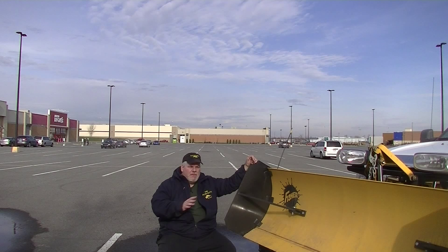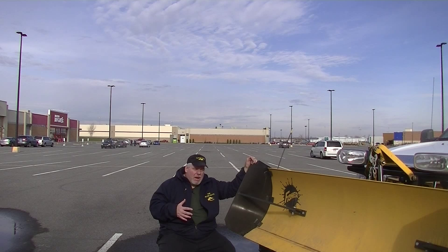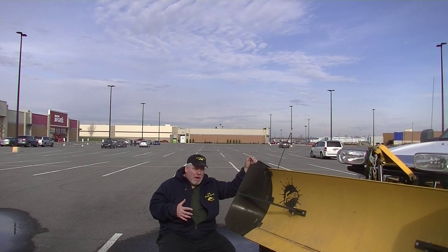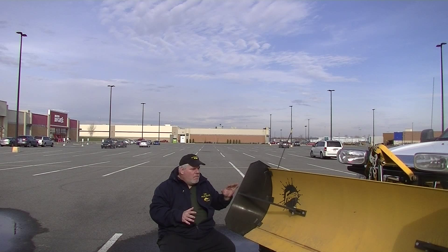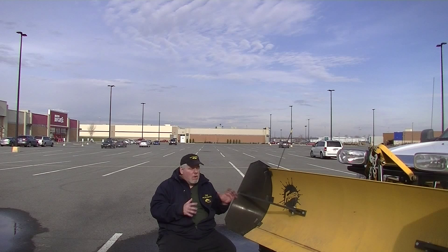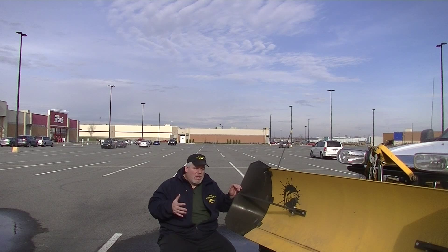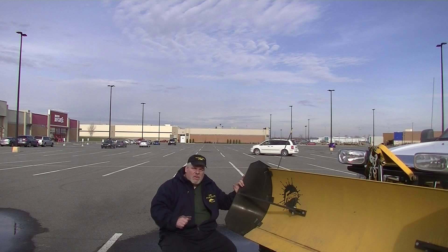When I bought my plow, to try and keep the weight light, I just stuck with a straight blade. I probably could have put a V-plow, and in hindsight I probably should have, because watching some guys plow with them I'm really liking them. But that's neither here nor there. What I did do is have these side panels and caps made to fit the plow. This is a common fabrication — a lot of the old guys with straight blades put these on to catch the snow and stop the spill-off. They really work well. If you have a straight blade, I strongly suggest you get something like this, unless you do a lot of wind-rowing where you're throwing the snow off to one side. But even still, these come off very easy.